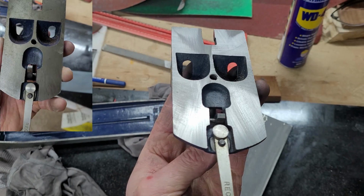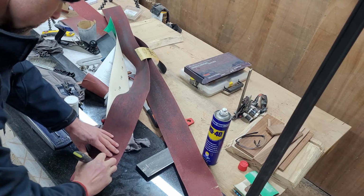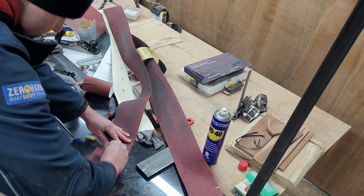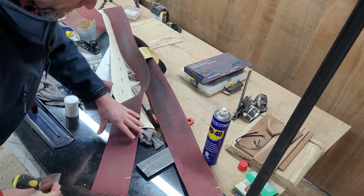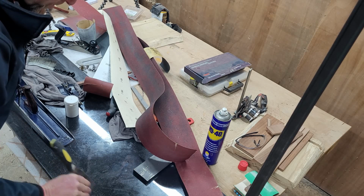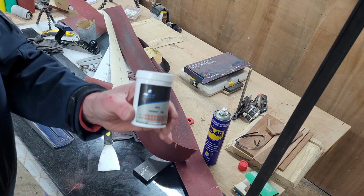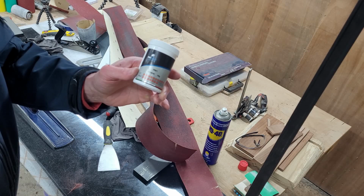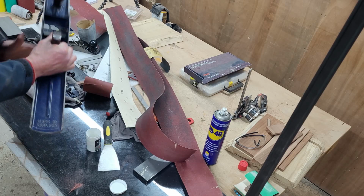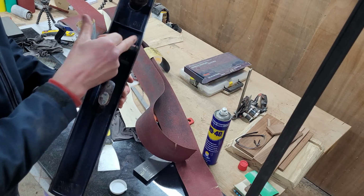However, the frog, you can see on the left hand side, is really badly manufactured, poorly fabricated, so I just gave it a little bit of sanding just to smooth it out. I didn't have any good compound or a product to sand off the contact surface between the frog and the sole, so I just tried to scrape off as much of the grain from the sandpaper and mix it up with my polishing compound, and used it as a sanding surface in between the main sole.